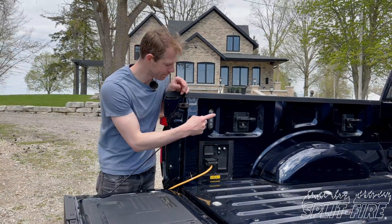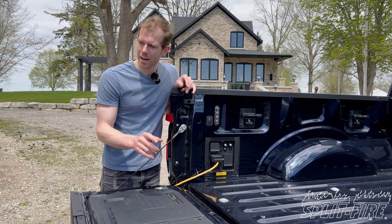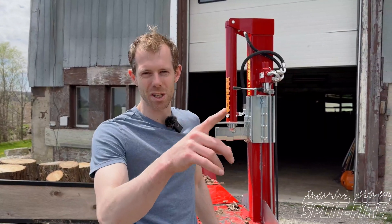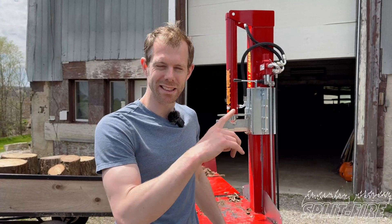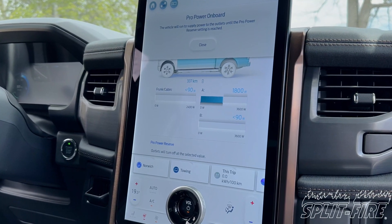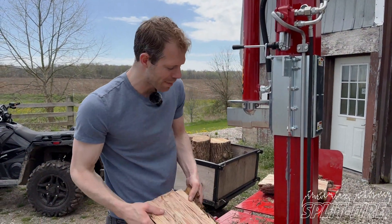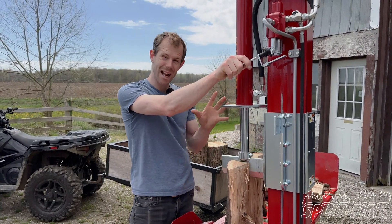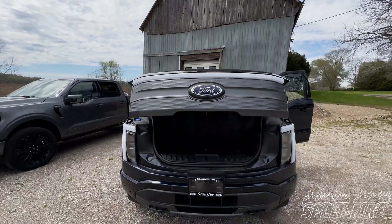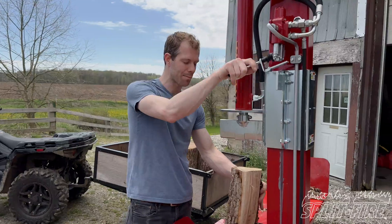We plugged it in, turned the truck on, hit the green button. When you release the green button you should hear that slight click again — probably a breaker in here enabling the circuit — and then you should be able to turn it right on. We have the power diagnostics up on the screen, so as I'm splitting we'll get a shot of that to see how many watts it's pulling at no load and also when splitting elm, which can be pretty full load sometimes. We checked the screen on the power diagnostics and it looks like the max it'll pull is about 2,200 to 2,300 watts, which is pretty good considering it has 3,600 watts available. That means we're not maxing the system, and it could probably run this a long time.